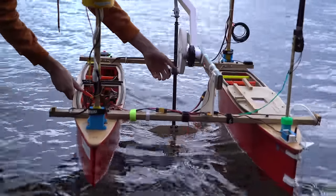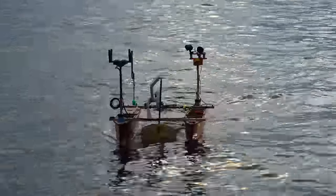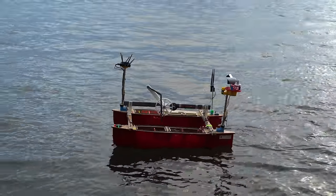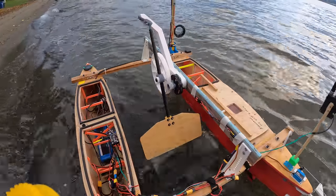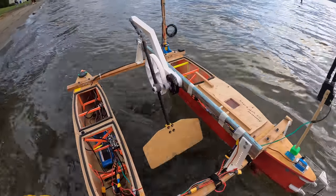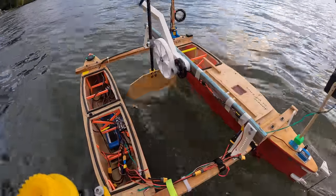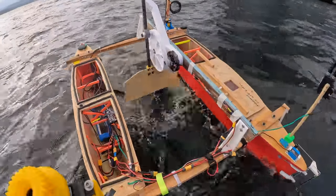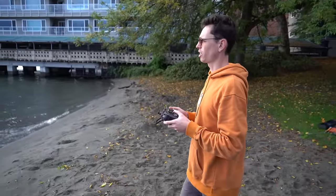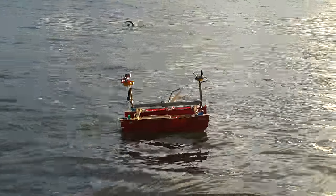I had to do a little bit of paddle height adjustment so that it wasn't hitting the water on the backstroke. At higher speeds, it would sometimes splash on entry, but I think this was in part due to the boat pitching up and down with waves. When I went to full throttle, it put a lot of stress on the gears and linkages. Combined with the paddle slapping into waves, it was enough force to cause the gears to start skipping. One of the axles had just slid out of place — easy fix, but I'd say this mechanism is only good for slow speeds. It's definitely not robust enough for super high-speed driving.